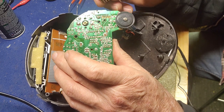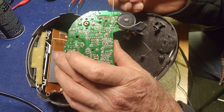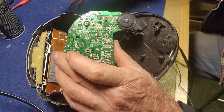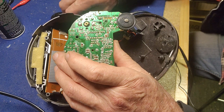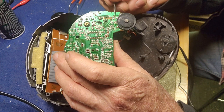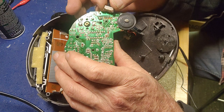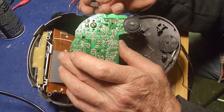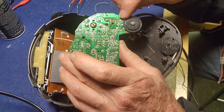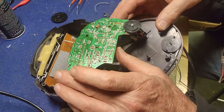What I'm thinking is that when the switch is set to AM it's essentially disconnected from the circuit, so the circuit must automatically be in AM mode. When you switch it across to this end, it brings another part of the circuit together - it must somehow disconnect AM and play FM. That's what I can't see how else it's going to work. It doesn't really matter how it works - I think this is why it wasn't working properly. The problem we've got now is that I can't solder the switch to anything. But it goes in from this side so I can push it straight in there, and I can run some fine wire - I've got some fine wire here - off the switch terminals back to a convenient place in the circuit, as long as we don't get in the road of our tuning dial. So I'm thinking I'll just physically wire the terminals that I need to, and as far as mounting goes the one end is okay, the other end I've got nothing to solder to. I'm thinking I'll just put a little bit of hot glue on that end.